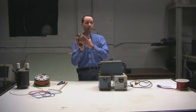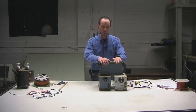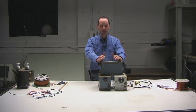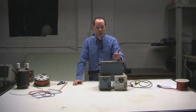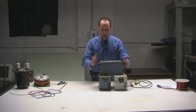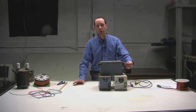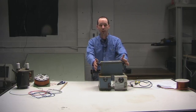And if you want to learn about them, you know, write in, we'll do videos on them. But start with NSTs. They're ubiquitous, they're simple, they're safe. I mean, even if you have to buy one, they're only like $100. It's not a big deal. Now, NSTs only put out 60 milliamps at most. You'll find rare ones that are up higher. You get into the cold cathode stuff. But as a rule, 60 milliamps is the biggest you're going to find.